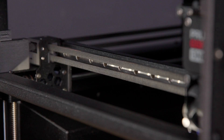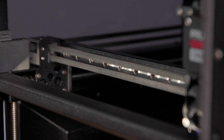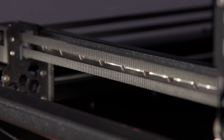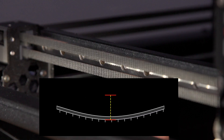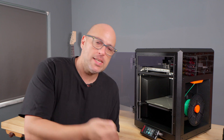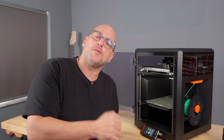Now, if I change the frequency at which the extruder motor is moving the belts, you will see a change in movement in the belt itself. Lowering it to 93 Hz, I can see more movement. If I lower it further, it starts moving less. What I'm looking for is the peak movement of the belt with smooth motion going back and forth, along with the highest peaks at the back and the front of the belt. So the aim is: when you set the belt tension to the frequency you want, the visual representation is that long smooth stride back and forth with the highest peaks at the front and the back. On the GitHub page for the alpha version, it specifically states it is okay to have a deflection of around 8 Hz between the top and the bottom — that is perfectly acceptable, so do not worry if you do not get them exactly on point.